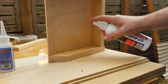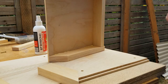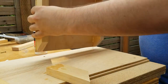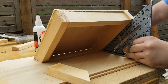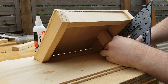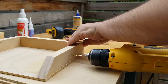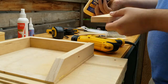Once the frame was complete, I needed to add some legs. I had seen people use super glue with activator to get a quick bond before strengthening it, so I wanted to give it a try. I used the speed square to get a 45-degree angle set and then placed the leg inside where it would be making full contact with both the ground and the board. The glue ended up getting absorbed into the leg with none of it on the side, so I switched methods and used wood glue and screws for each side.